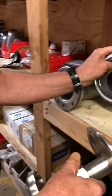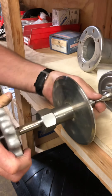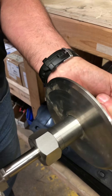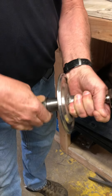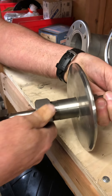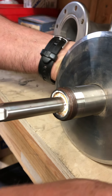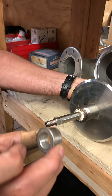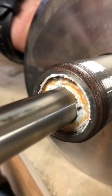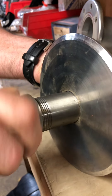The other problem we have with drivers is on the valve itself. I've taken this apart to make it easier. This nut right here — when you pick your trailers up from a tank wash, this nut should be snug, tight all the way, right in like this. When you pull this nut off, there's a packing inside. A lot of times we'll have product dripping out of here on the packing and we won't know why it's leaking. If you take this nut off, inside here, this is how it goes together. You have this piece right here which pushes the packing inside. This packing is the white part — that's the part that goes bad. So this nut comes on like this and then it screws on like this. That's how it goes in.